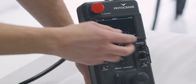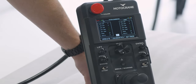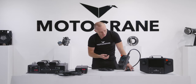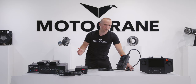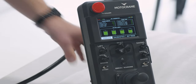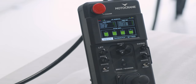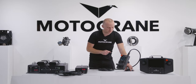Moving on to diagnostics, I'm able to choose between system or UPC diagnostics. Going into system, we'll find parameters like motor temperature, driver temperature, and also an info button which shows me which firmware versions are loaded onto each of the modules that are connected. Going into UPC diagnostics — again a familiar layout if you've seen this on the extended controller — I'm able to monitor each of the v-mount batteries individually and also look at my charge monitor and power core parameters specific to the UPC.